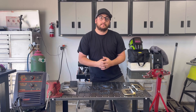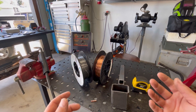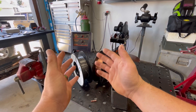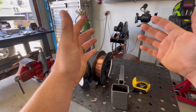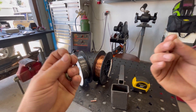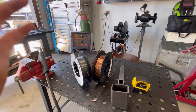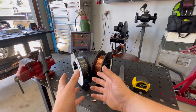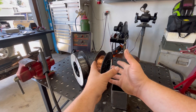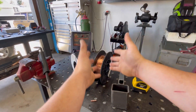Let's talk about the limitations of this welder. It's a Hobart Handler 140, and it can output between 25 to 140 amps. It can run two processes: flux core wire, which is a gasless tubed wire, and solid wire for gas metal arc welding. Both have limitations based on stock thickness. The flux core wire can weld up to quarter-inch stock at the machine's highest setting, so that's why I would use flux core most of the time with this machine. I use gas metal arc for smaller stuff like frames, quick repairs, and installing catalytic converters.